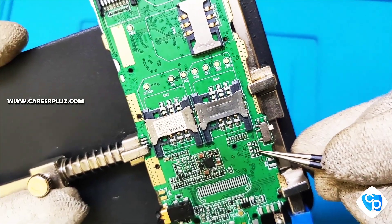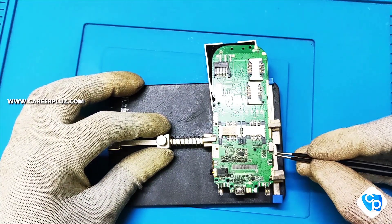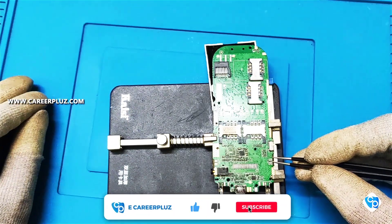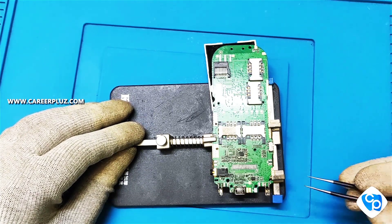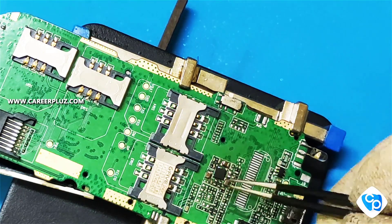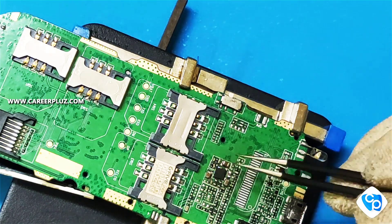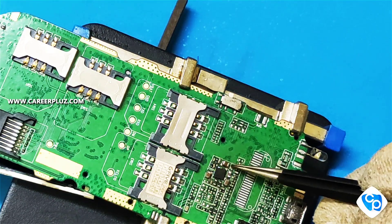The components are resistors, capacitors, transistors, and so on. Many will use the soldering process and heating — during the heating process it may melt, making it easy to remove. You can fix a nozzle accordingly and use an SMD rework station for removing it. The air should be at the minimum level and heat should be within 300. Set the minimum air level to one.